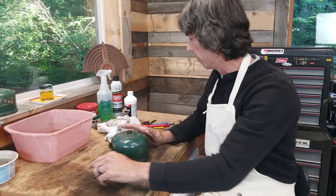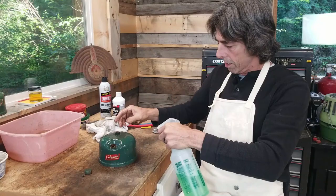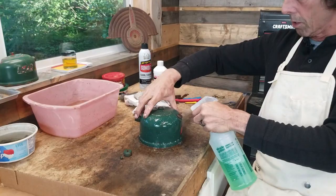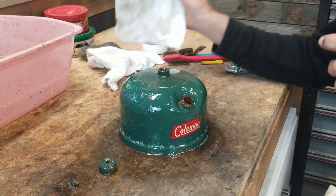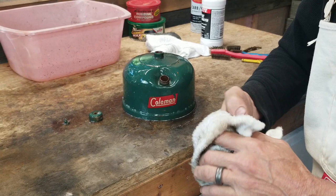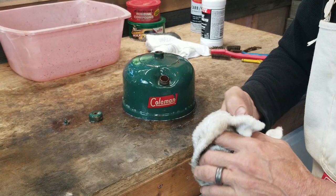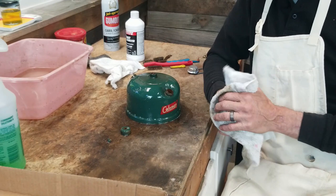Next comes the fount and the filler cap. The first thing I'm going to do is just shoot it with Simple Green. The fount is not in too bad of shape - it's got some scratches but no dents or serious problems. I did smell a little bit of varnish when I took it apart so I'm going to have to clean the inside too. I'm going to put a little bit of vinegar down there and let it sit for a few minutes to get some of the varnish off the bottom and address the little bit of rust in there. I'm going to put some small screws down in there and shake it around to break the rust loose, then rinse it with water and once it comes out clear rinse again with alcohol to get the water out.